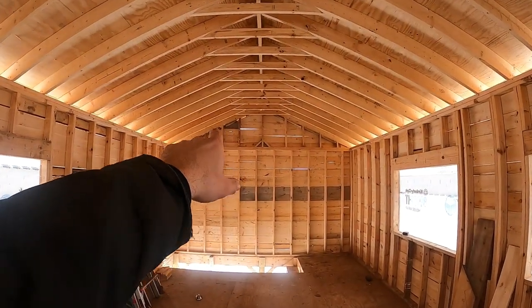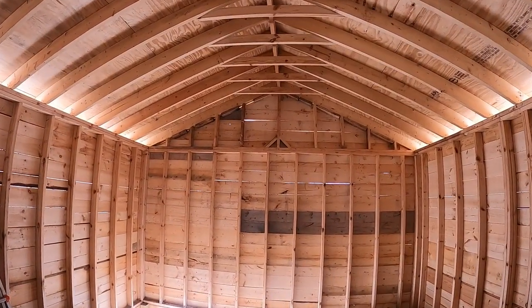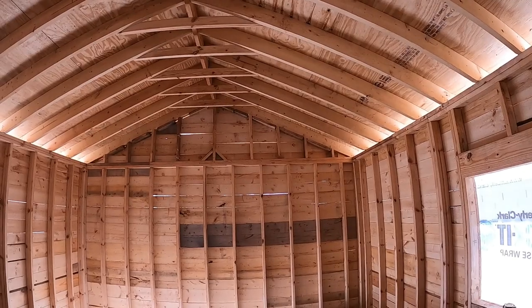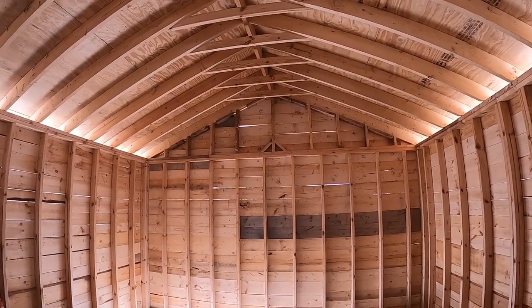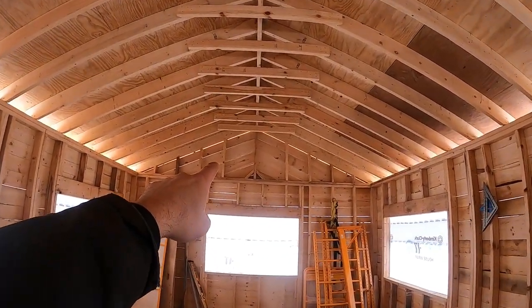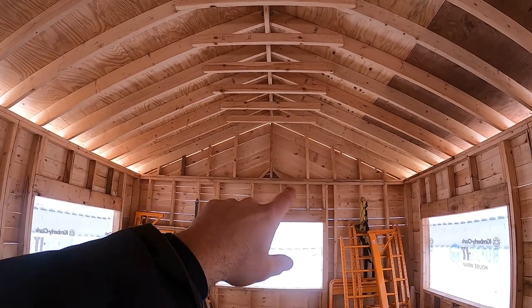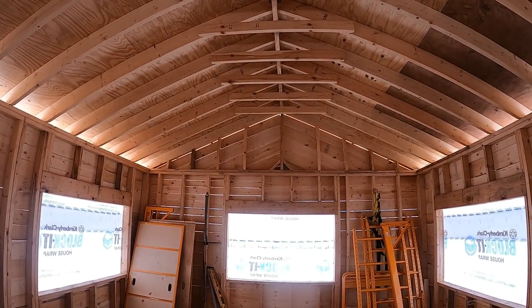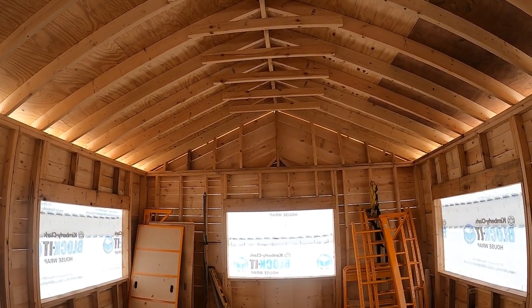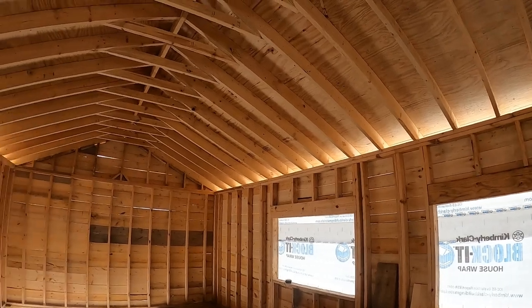The boards on the end — you can see how they go straight across at the peak. I'm not a very experienced builder. I started doing it that way and had to scab in a bunch of two-by-four scraps just to have something to nail to. Then my wife suggested cutting them on an angle, so we did that and I didn't have to scab anything in. It worked out great. If you're doing the peaks, cutting boards at the same angle as your roof works great and it's really not complicated.